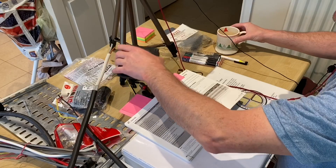What sort of enclosure would I need if installing on the outside of the building for garden lighting? An IP-rated enclosure. Here's a box from Wiska - IP66, though it can be IP67 or IP68. You can fill these with resin as long as you use the appropriate glands. If this box is screwed to the outside with a PVC cable into the back, Wago connectors or screw connections inside, and coming out to garden lighting - what type of gland will I need on the actual box itself?